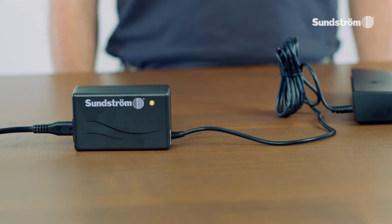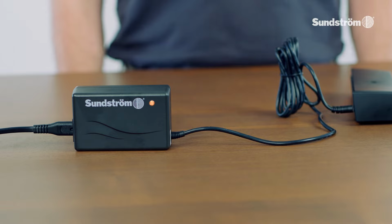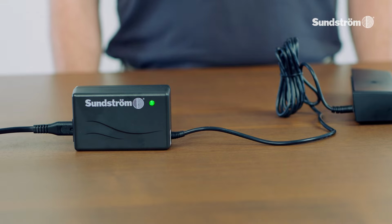Yellow. Battery analysis and initiation. Orange. The battery is being charged at maximum charging current. Green. Yellow intermittent flashing. Top of charging mode. Green. Charging completed. Switches to maintenance charging mode.